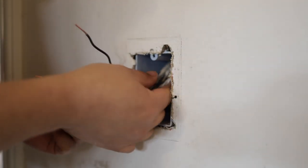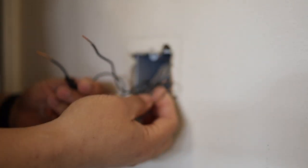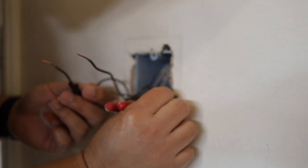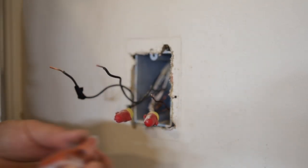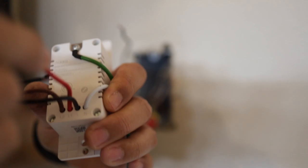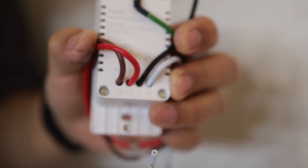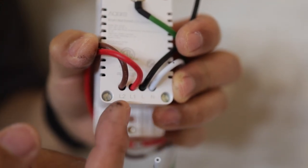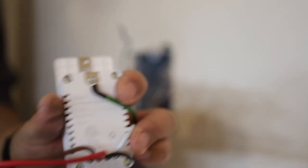Power's back off and I can confirm by testing the wires again. The bottom one was the line live wire. I'm going to pull the tape off the top one and leave tape on the bottom so I know that's the live wire. I'll pull all the wires out of the outlet box. This is the neutral wire bundle and here is the ground — bare copper is always the ground. We'll be using the supplied wire nuts. The green is the ground, white is neutral, black is the line wire, and they have L1 and L2 marked for load one and load two.